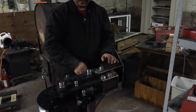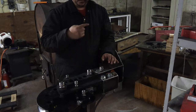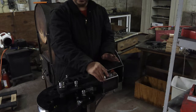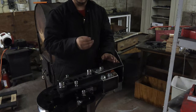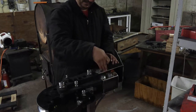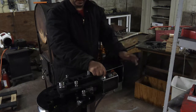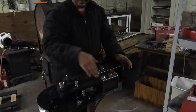If I box this in on this side the way I did here and try to sell that, if there's any variation between the thickness of this between vendors, one of two things could happen. Either they're going to fight to get this onto it because it's so tight — they'd have to use a hammer, maybe try to pry it apart. Or it might be a little bit too big, and even just a sixteenth of an inch could be a big deal because you have a full plate back here keeping top and bottom from compressing when you put these bolts in. I would just rather not have that situation where you're fighting against a solid plate to compress these.